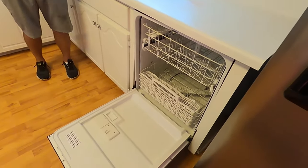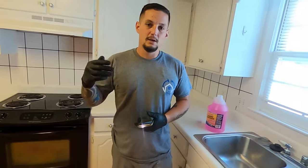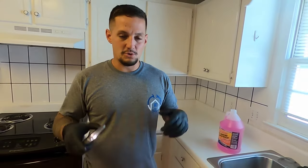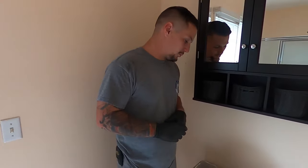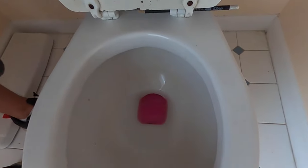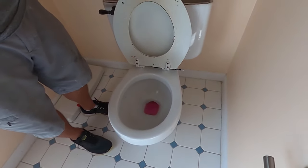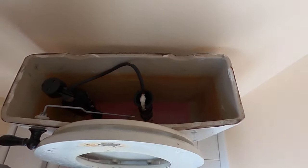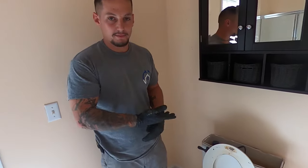We don't have enough time in this video to go through every single location, but I will list them off: the washer drain, the showers, all your P-traps, your sinks, your dishwasher — make sure you get antifreeze in all of them and get a good photo of everything. When it comes to toilets, there's a lot of misinformation out there. What I typically do is make sure I put enough in to where it comes up to the back of the lid. You don't want to just put the bare minimum — when you come back in a few months it'll be gelled up on the bottom serving no purpose. Put enough in so it comes up to that rubber grommet surrounding the flapper valve — typically about a half inch in the back, up to that bottom ridge.